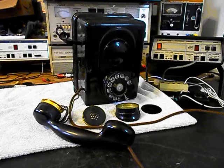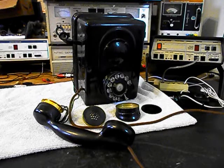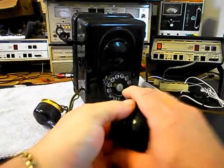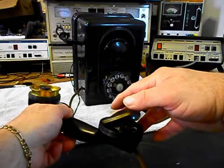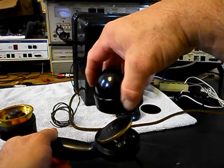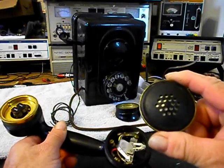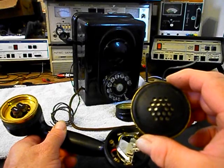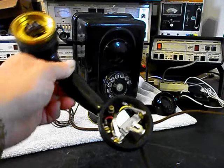What we want to do is upgrade the transmitter too. We're going to go to an electronic amplified transmitter that I designed and built here at the shop. This is your spit cup for the transmitter. The problem was it always gets caught up when you're taking off the transmitter cup or putting it on, and things start spinning around in here. Plus we want to get rid of this carbon granule transmitter because they can become noisy and sound like there's a static sensation after they have some age on them. So we want to go ahead and upgrade it while we're taking care of everything else.